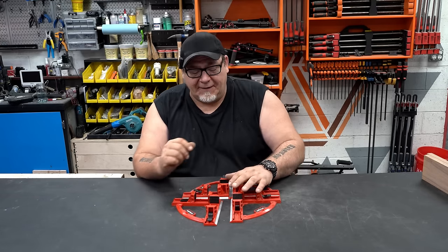Typically on a drill press vise you'd lay it down and either hold it, clamp it, or use the slots to bolt it in place. What's really nice about this is I can position it anywhere and lock it down simply by turning the magnets on, which makes it really easy to adjust. One of the side effects I probably love the most is that I no longer have my drill press vise handle bumping into the drill press — I can literally flip the whole thing with my finger, which makes it faster and easier to use. I can adjust it anywhere I want just by moving it around, lining up my drill hole, and locking it in place. It's nice and secure and I don't have to move my drill press bed around to try and line it up.